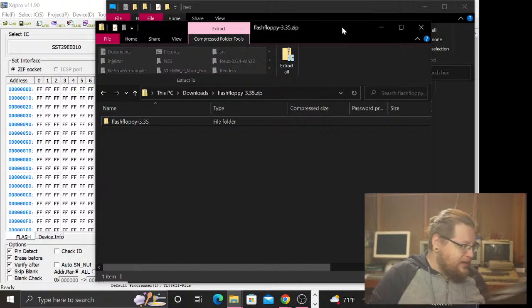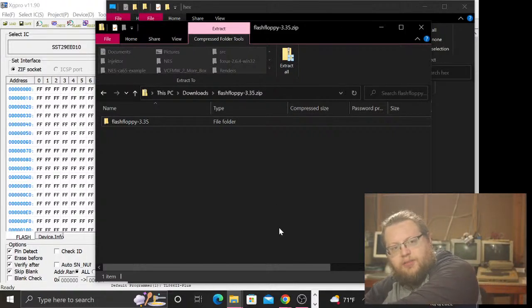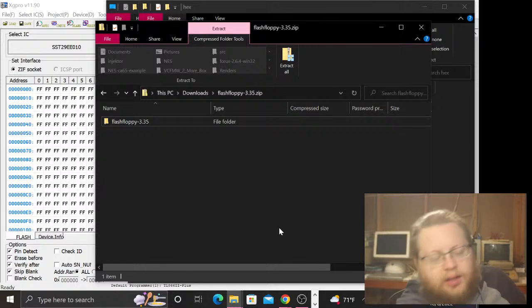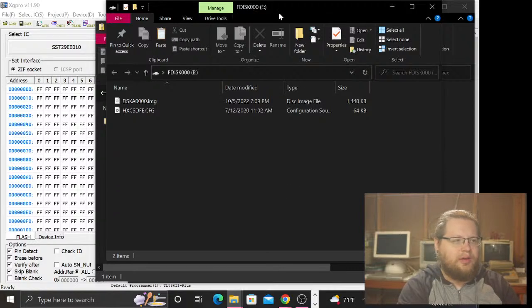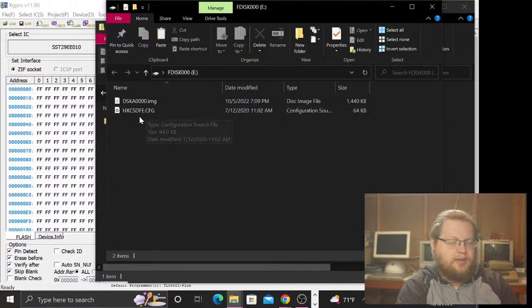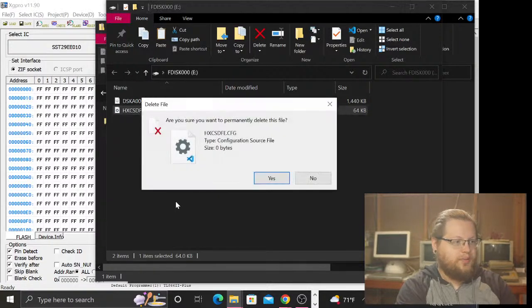Let's get this laptop out of the way, because I'm not going to use it. And let us pull the Gotek drive and put it over here. Apparently you have to set a jumper, firstly. I don't think it really would affect us too much, but you have to set a jumper or configure a thing in the configuration file to make this thing work in IBM PC mode, because there is a pin that is non-uniform, and apparently that's not the default. So I don't think that's what was screwing us up, but firstly, I'm going to get rid of this horrendous thing, because that was a mistake.